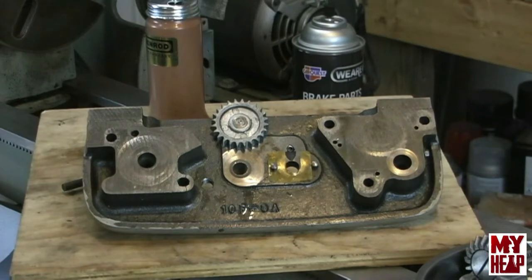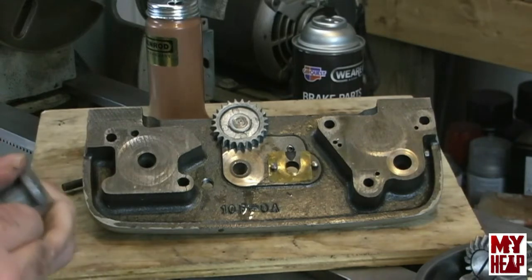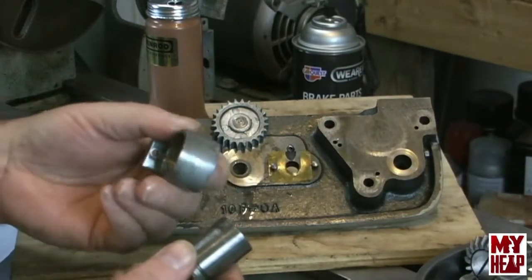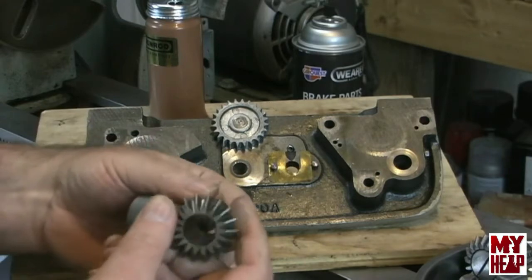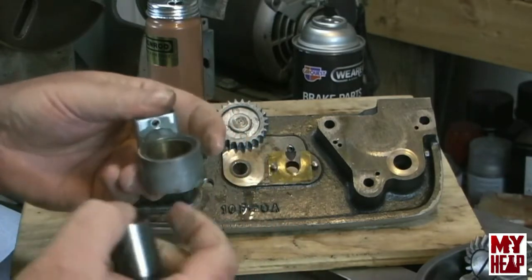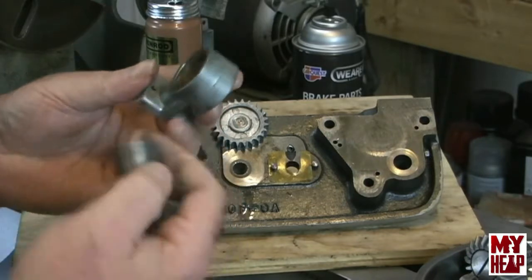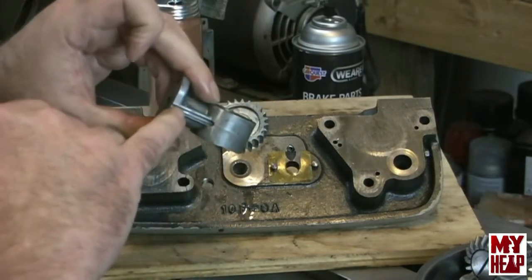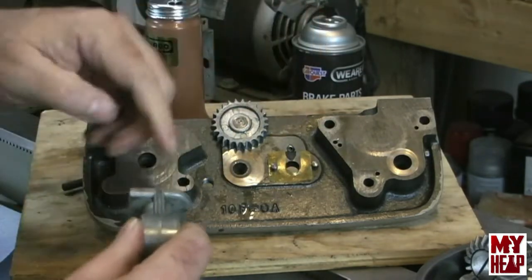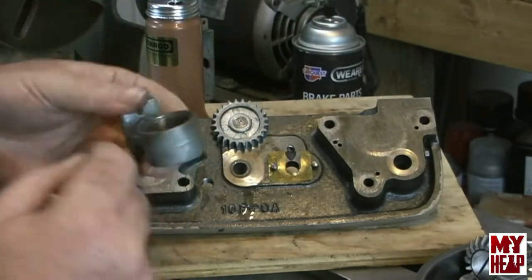And then on top of that, we have the bearing for the, let's call it the lead screw bevel gear. And remember, I think I told you in the last video that I ordered this one off of eBay because mine was worn out. But something I wanted to point out, I pulled this apart, and you see there's this little groove that, when you push oil through this, the oil should run down this groove and into this bearing.